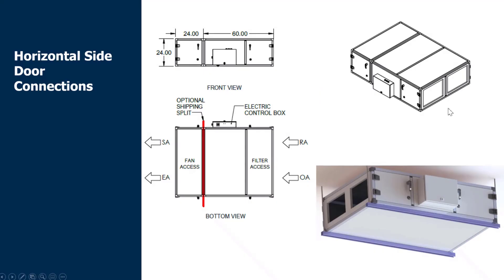Another key component of our Nova line is the side access door sections. You'll see here we have side access doors, and in the bottom right there's the typical mounting using a rail and some threaded rod. You can do this when you're really tight for space in the ceiling plan. There are four access sections on this unit — one on each corner — for the two fan maintenance points and the two filter changes. There's no downswing or upswing on the doors, so it remains compact, with clearance requirements only on the side of the unit. For select units we also have the optional shipping split, shown here in red.